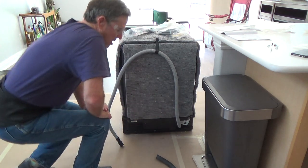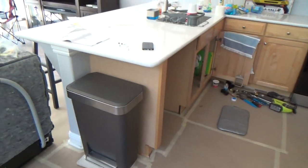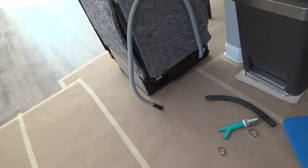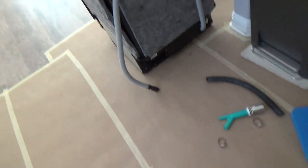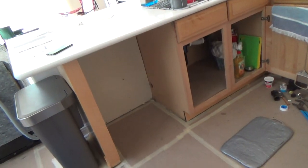We decided to go without the air gap. I asked if a brand-new install inspector would okay that, and the countertop guys — who install countertops every day — were pretty sure they would. I also talked to a professional plumber who had helped us install a tankless water heater earlier. He said yes, just do the loop up above in the cabinet. So I'll loop the drain line and tape the loop or tie it with some wire to make sure it stays up higher than the garbage disposal.